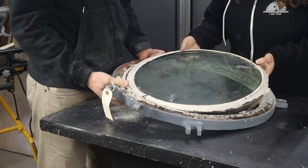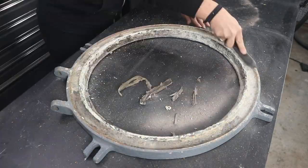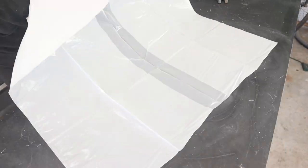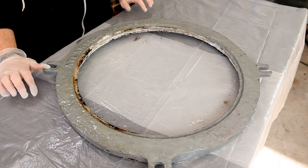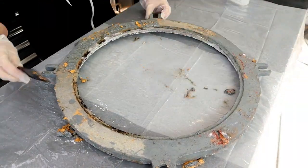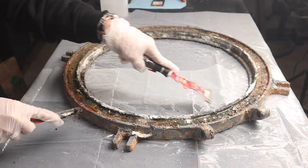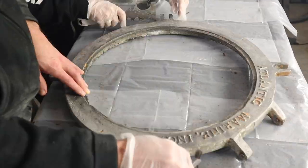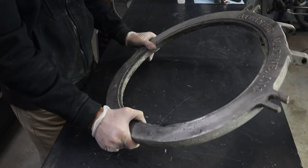Due to the age of the porthole, removing the window was a one-step process, but it was quite dirty. So we spent a little bit of time cleaning off all the loose dirt and flakes before moving on to stripping the globs of paint off of it. Many, many layers — I don't even think the Atlantic Marine Company is a company still; I couldn't find them on Google. Stripping the paint took several rounds of spraying on the paint stripper, letting it sit, scraping it off, paying attention to the front and the back, scrubbing it pretty intensely, and detailing the letters.